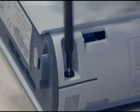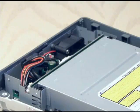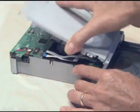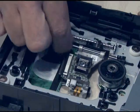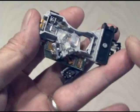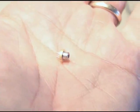The side panel snaps off and reveals some hidden screws, so get to work and remove all of them. After popping off the cover, it's time to get rid of some more screws until the DVD drive is freed up. A couple more screws removes the cover, which reveals the blue diode assembly. The guide rails and some cabling hold it in, but not anymore. Tiny screws hold in the housing and the blue diode is located and snapped out of the assembly. The small circuit board is desoldered and now we have the naked blue diode.